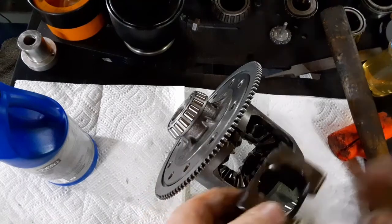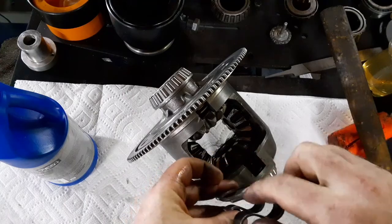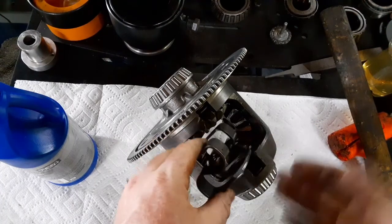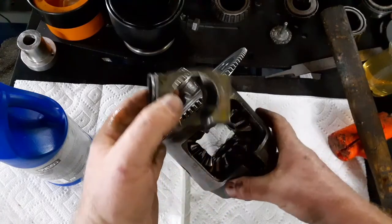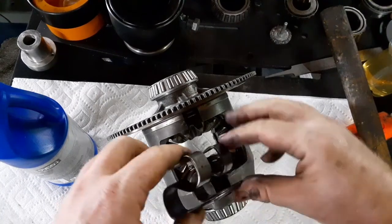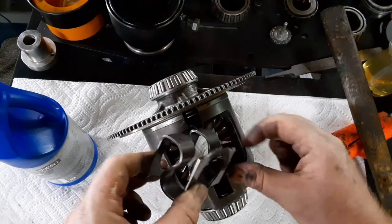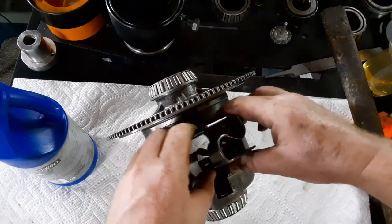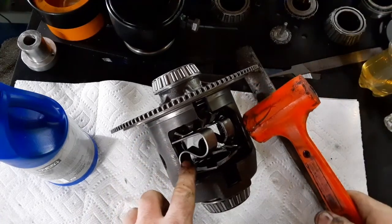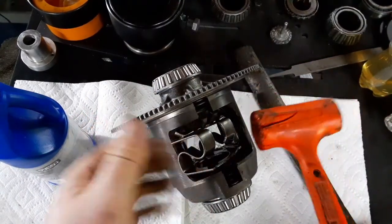Now for the fun part - the big spring. The big spring is not easy to put in. You can grab it with some vise grips and compress it some, but I really don't like to do that because you could alter the shape and then you're losing your push-out. This point right here is the weakest part of the spring, which means if you push up on this piece you can compress it the easiest. So I like to put this part up against the top gear, then compress it just enough to get it in there - just like that, it's not too difficult.